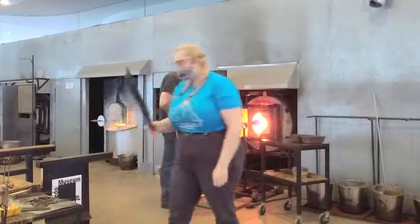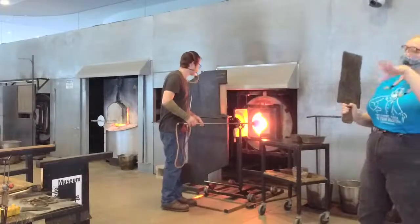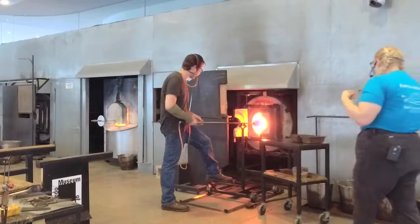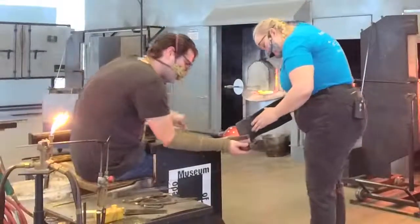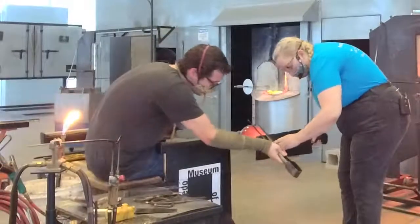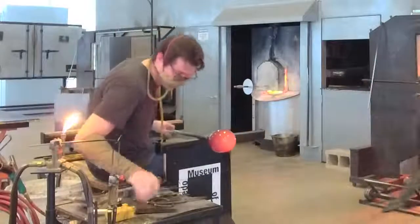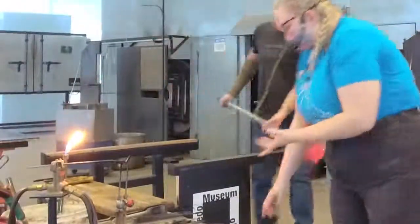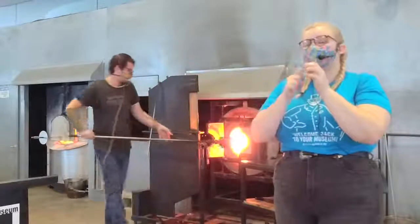I'm going to use one of our wooden tiles — this is just a nice straight piece of wood. This will allow us to sort of control how the object makes contact with the table. If we have something that's rough and bumpy on the bottom, we have to put in a lot more work after something comes out of the annealer in order for it to make nice contact with the table. He's using his jack almost like a tool to change the shape of the bottom of the apple, giving it a nice little indent. When you pick up a wine bottle and look at the bottom, you can see how the shape was changed so that just the ring on the outside touches the table.